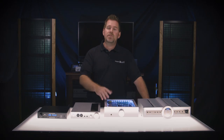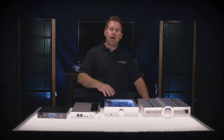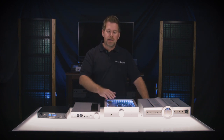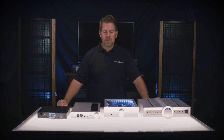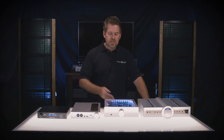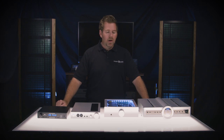The next level down is what we call the SL Conductor 1550. It's at $1550, and it's basically a scaled down version of this model. They go from a machined chassis to a folded aluminum chassis. They use the Noble pot instead of the resistive stepped attenuator, but we're implementing the same DAC board. You lose the preamp outputs and the DAC outputs, but you have 1 analog input, 1 coax input, and 1 USB input.